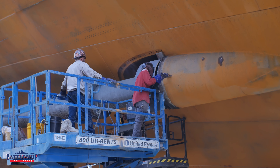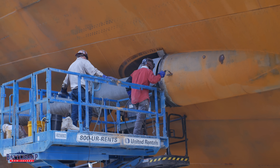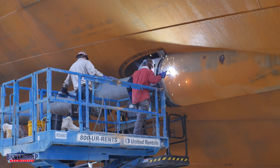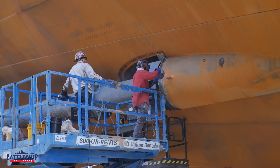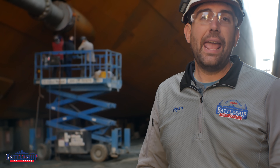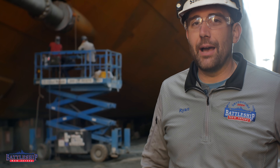So now this is an extra belt-and-suspenders protection for the ship that is both going to keep the water away from the gland seal — so that collar has to fail before the packing becomes impacted, and then that has to take however many years immersed before it will fail — and it's going to help support the weight of the propeller and shaft and keep it from setting down on the packing, crushing that, and opening a gap at the top.